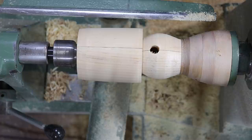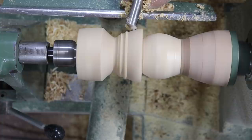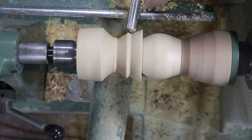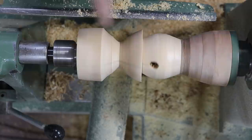Now we're going to put the roof on. Once again, if you take your bowl gouge and start out here, working your way across keeping the bevel riding, you'll get a nice clean edge with no tear-out. I kind of like the shape of that — I'm just going to round that up and make a nice little hut-style roof on this.